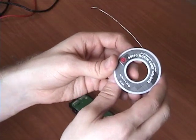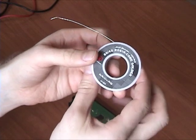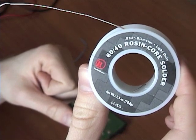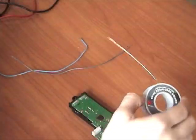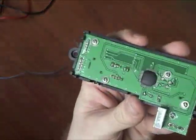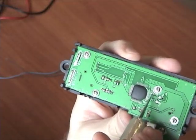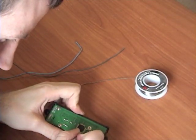While I'm waiting for the soldering iron to heat up — I'm heating it up to 700 degrees Fahrenheit — this is the solder I chose to use: 0.032 diameter 60/40 rosin core solder. You can buy this at Radio Shack. It's pretty small, which makes it so you don't get big globs of it when you're working. So those two points that I showed you before, I'm just going to scrape them with my X-Acto knife here just to make them a little rough, which I think will make the solder stick to them a little better.